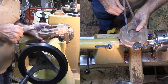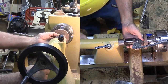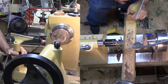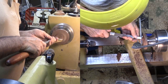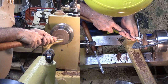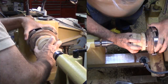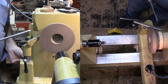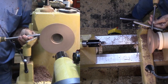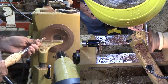Finally, I need to glue the top to the bottom. The bottom has some extra wood protruding that is preventing a good joint. I'm tooling that back into somewhat of a tenon into the magnet hole. Then I glue the base to the top with the magnet encased in between. Finally, I can actually tool the bowl. It does not take very long to shape the exterior and hollow the interior. I need to be careful of my dimensions, especially not to expose the magnet either from the top or from the side.